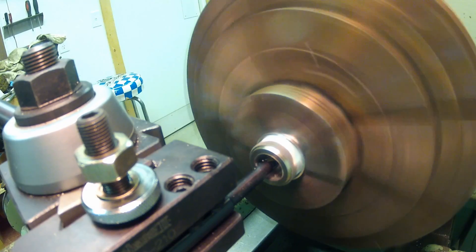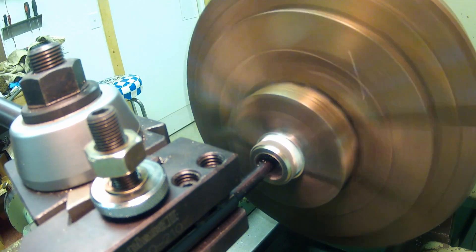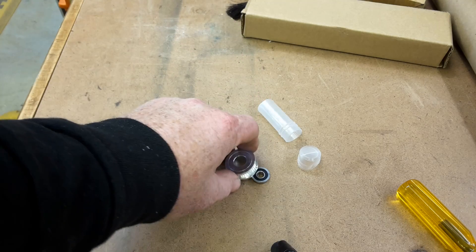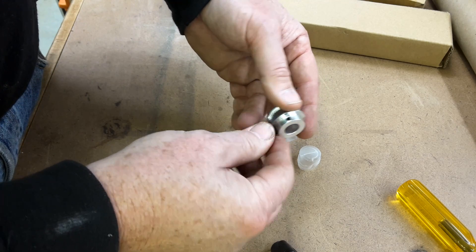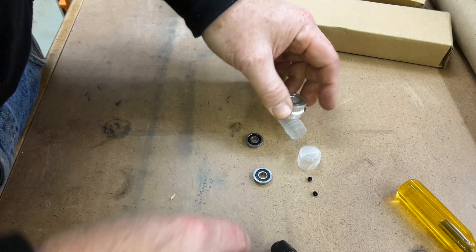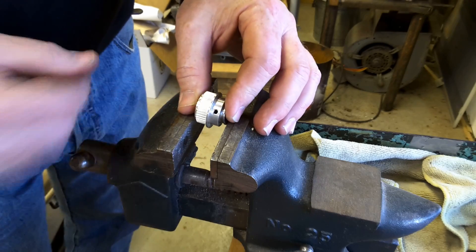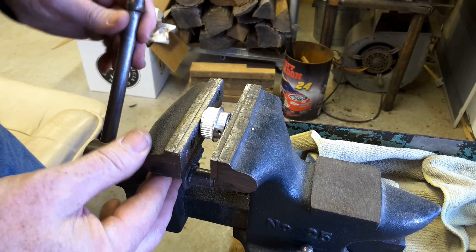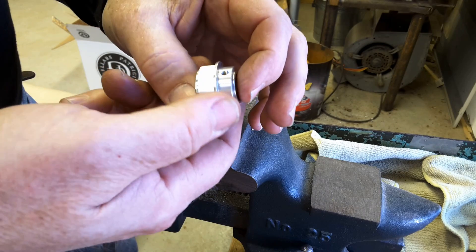I made it fit with a slight press fit, and although there's a keyway on this planetary gear I don't have a way to broach a keyway into this small little cog. The next thing I started working on was the idler pulley at the opposite end — it's part of the tensioning assembly. I used the same size cogged pulley but it doesn't have any bearings in it, so I had a couple of leftover shoulder bearings. I bored it out and made these a press fit — and there it is, I think I made my first fidget spinner.